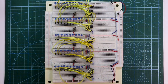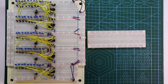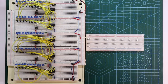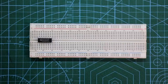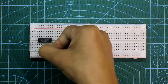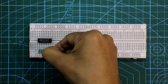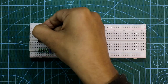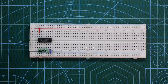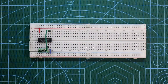After completing this, here is another breadboard. Now put the IC 4073. Pin number 1, 2, 3, 4, and 5 are connected to ground through 10kΩ resistors. Pin number 7 is connected to ground and pin number 14 is connected to +VCC. Pin number 6 and 8 are both connected together.